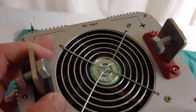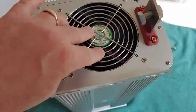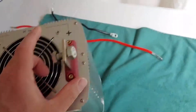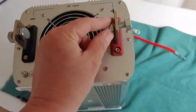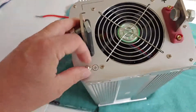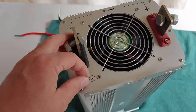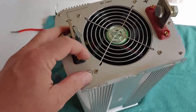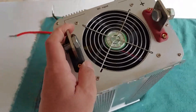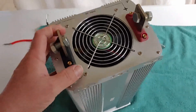Let's look at the other side. On the other side we have our terminal connections, of course. We have a fan, which runs really well — it keeps it cool and hasn't given me any problems. We have your positive connection for your battery and the negative connection for your battery. Here is a ground. The one I have in my battery backup connected to the house, I use the ground. But this one I mostly just use for in-house areas where it's going to be moved around, and in that case I don't really use the ground.